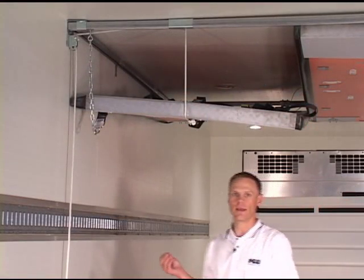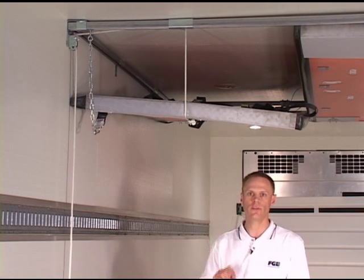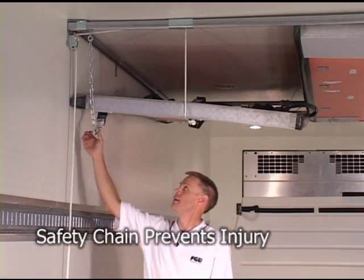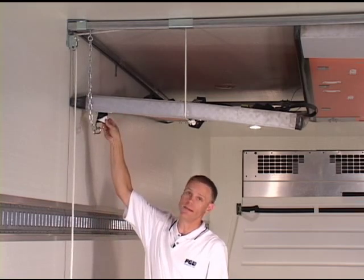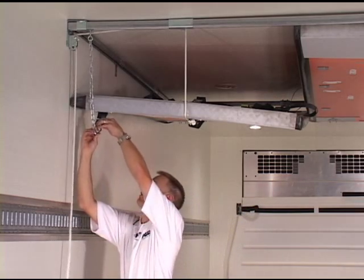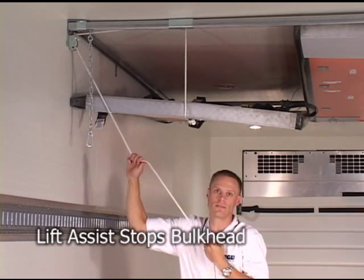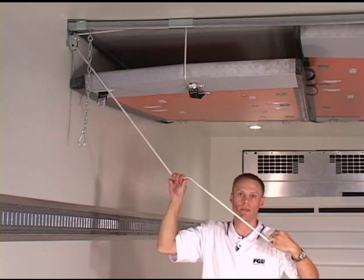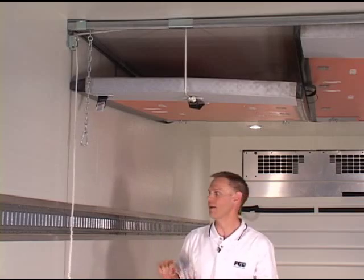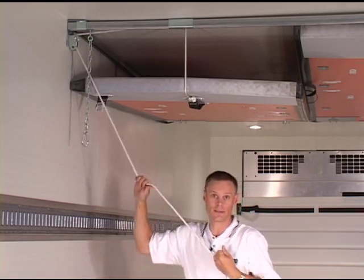With any track bulkhead design we're always concerned about safety here at FG Products. This track design has two safety mechanisms built into it. The first is the safety chain, which should be firmly connected to the D-ring before you lift each half of the bulkhead up to the ceiling. Secondly, the lift assist has a safety mechanism built in. If I open the gate so that the bulkhead can slide freely down and let go of the rope, the bulkhead stops — because the knurled roller has grabbed the rope and firmly stopped the bulkhead before it lands on someone's head.